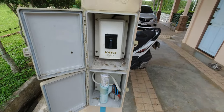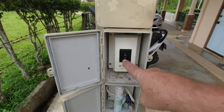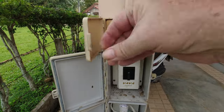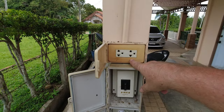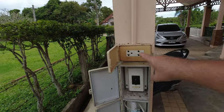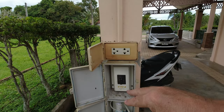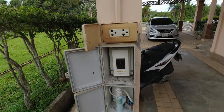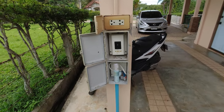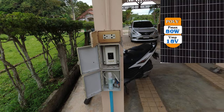That's where it comes in — there's a little breaker, a little gecko in there. The breaker connects to the outside socket, so the grid tie inverter feeds into the system. If the power goes off, the grid tie inverter goes off as well, so it doesn't add charge to the lines. This is only a very low wattage — an 80 watt solar panel — so it doesn't give many amps anyway.